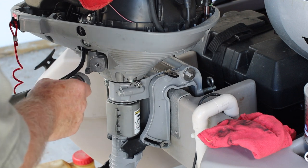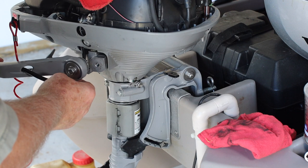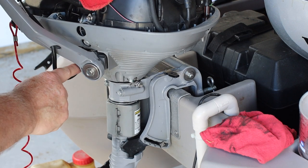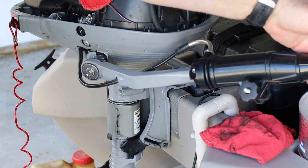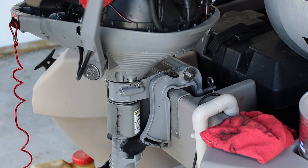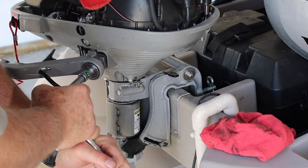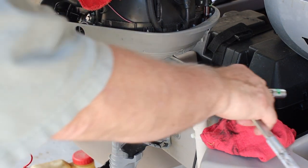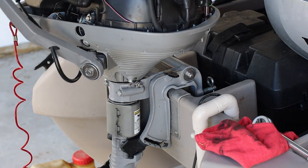This cable goes on the other side. Now I'm going to get it started. You have to have this on the upside because there's a little stopper here — if I put this on the other side, when it went like this, this would be binding here. So this stays on the bottom side of the arm. I made it snug but I'm not going crazy — that's a 12 millimeter socket that goes on this. See how everything's clean and all lubed. Page 46 of the manual right here shows all the lubrication points.